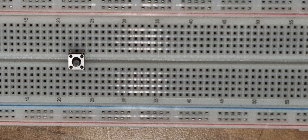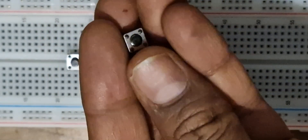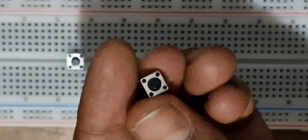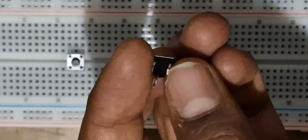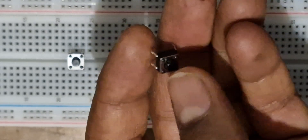We want to know whether it is functional or not. So let us see how this switch looks like. In my hand I have this switch and it has got four pins — four metal pins — and there is this button here which you can actually push. It's just push and release, so it comes up after pushing. We want to know when it is not pushed which of these pins are connected to each other, and when it is pushed which of these pins make connection to each other.